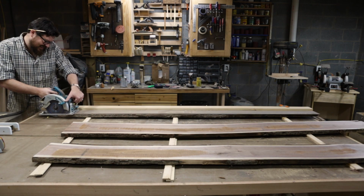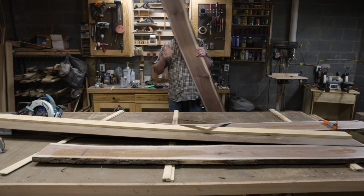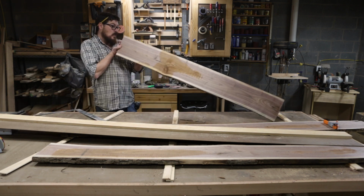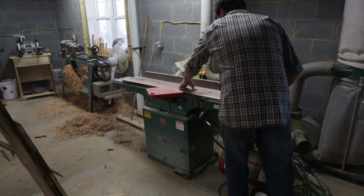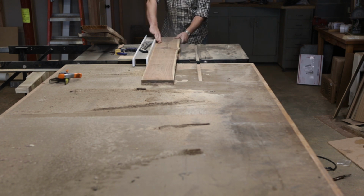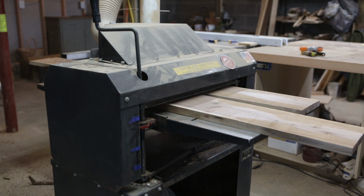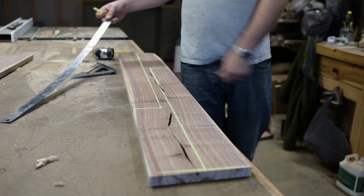In the meantime, I'd skip planed and straight lined some walnut I had lying around. These came from a sawyer who said they had milled some branches. I should have known better. Not only did the sawyer leave parts of the pith in the wood, but branches are normally considered reaction wood, since they grow trying to combat the forces of gravity, unlike the trunk which grows straight up, not out. There are added stresses in the wood which react when you start to mill it. Cupping, twisting, checking, and cracking are all defects that reaction wood is prone to.